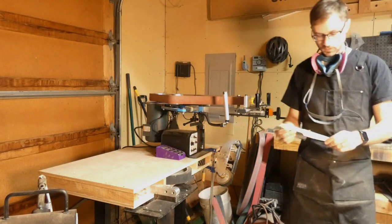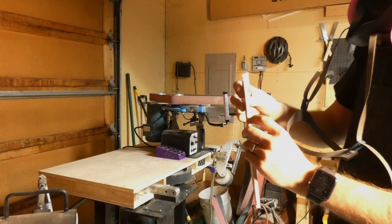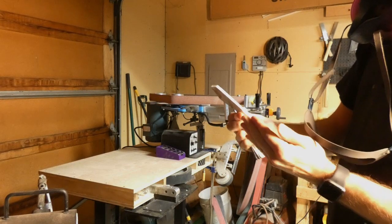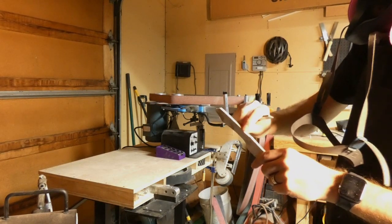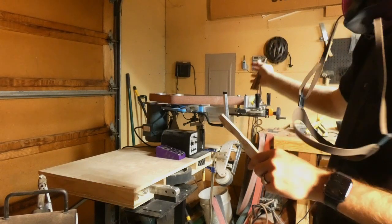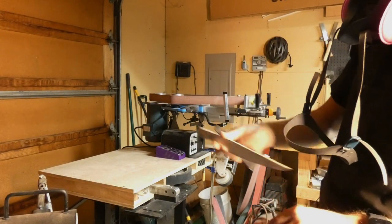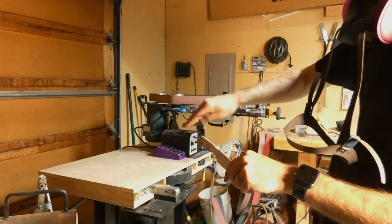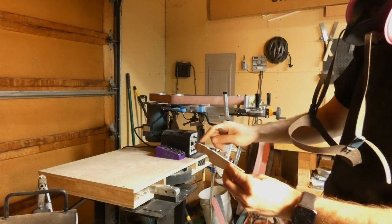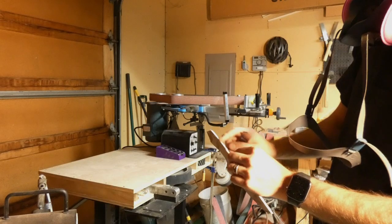You can see on here I've got a knife blank and I want to taper the tang from the handle transition back. What you're doing is taking an angle cut, so you want to get this tapered tang line parallel with the wheel of the surface grinder because it's going to be a horizontal motion and you just want to nip off that much. Usually I go tapered tang from here all the way back — it makes a much shallower curve and it's kind of easier to do on the surface grinder — but let's just say you want to do it right here.